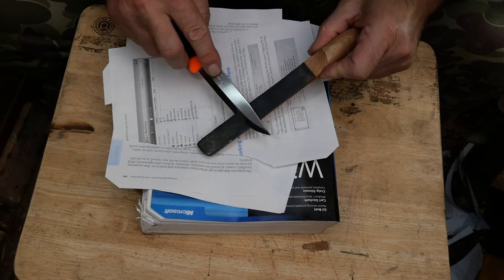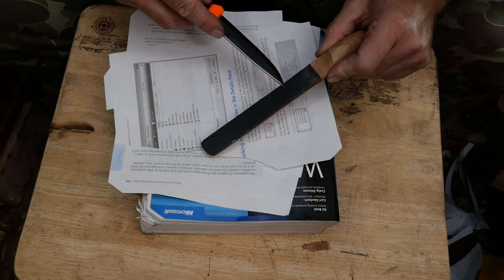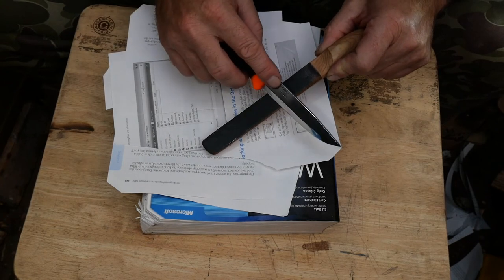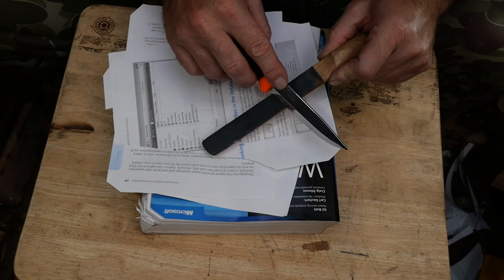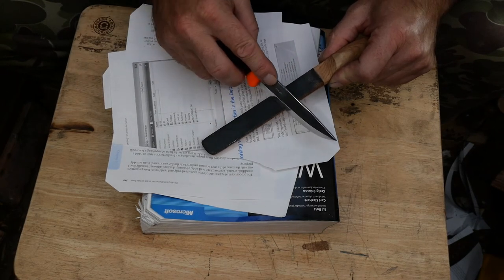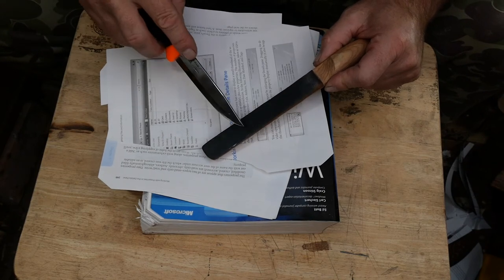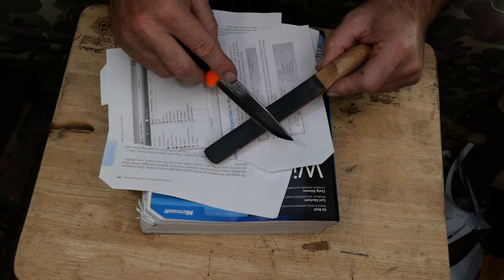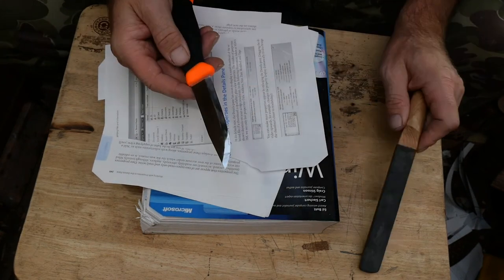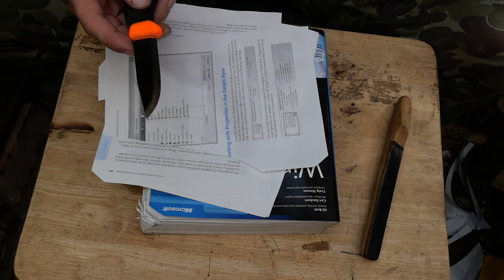We've just got our bevel and now we do our edge again — go up steeper, basically polish our edge off very gently. Because it's the apex that wears, it's the apex that gets the scratch pattern in it. That's the thinnest part of the steel, and that's the part that's going to wear. First it's going to lose its polish, and then the scratch pattern is going to get deeper and deeper until you would say it's a micro serration. If you go past that, it becomes a mid-sized serration, then a large serration, and so on. So that's why you have to maintain the edge steeply — you have to polish the apex. The only way you can do that is by going steep, sort of dragging it across, but very gently.